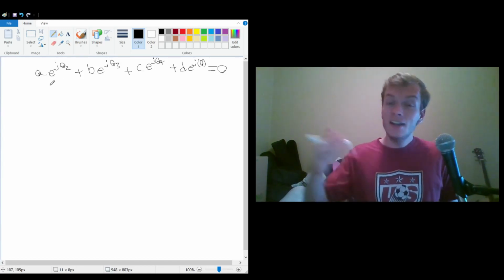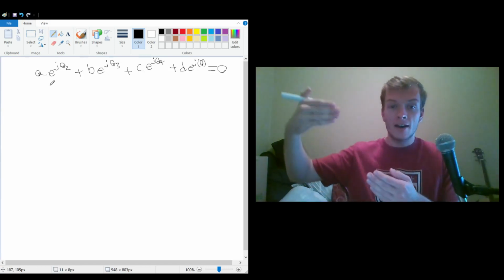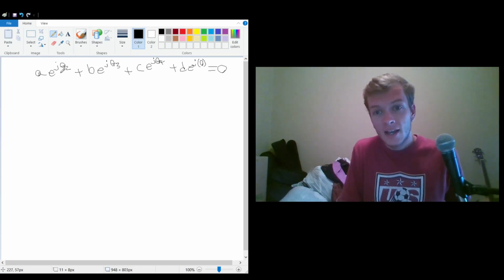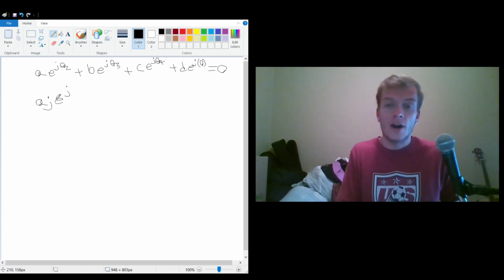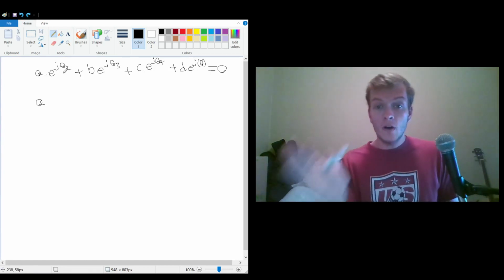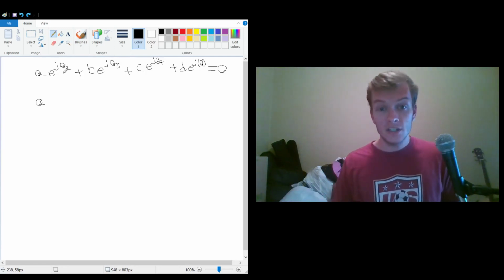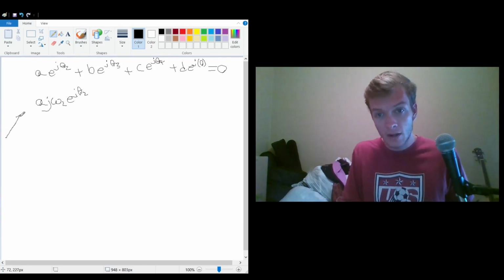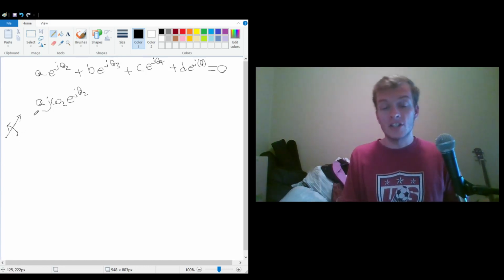What's nice about e to anything is that the derivative of that is e to that same thing times whatever the derivative of the thing in the power is. So we have to take the derivative of theta. And the derivative of the angle is the angular velocity, just like the derivative of the position is the regular velocity. So this is going to be a j omega 2 e to the j theta 2, omega being the angular velocity. So if we had our vector here, this would be the rate in radians per second at which this vector is changing.